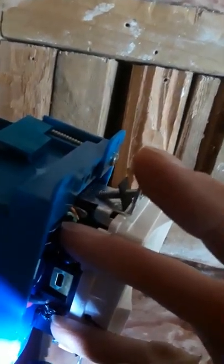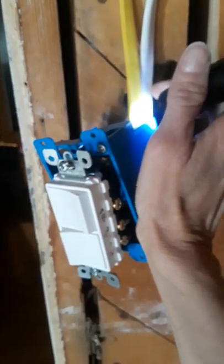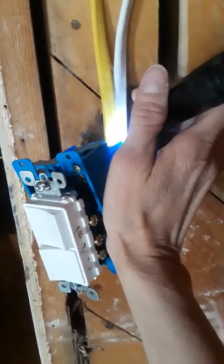Let me show you here. You'll see these are black screws and they're the commons. And then we have a fin right there in the middle — see that brass fin right there? You want to leave that connected. So the black screw there connects to the black power wire and this just kind of travels up and runs that. And then we also connect our grounds. Over here we have the black wire and it kind of runs through this wire here. So we have our black, red, white, and ground wire.